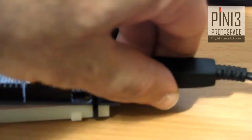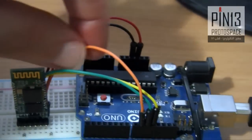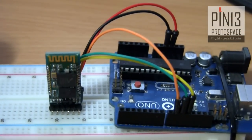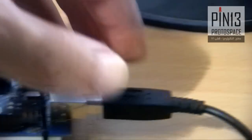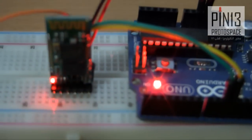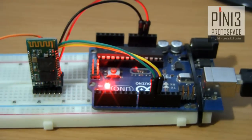Once I'm done with this, I remove the power from the Arduino. Now I need to remove the key pin — this jumper wire connected to pin 9 on the Arduino, which is connected to the key pin or pin 34 on the HC-05. I disconnect it and plug it into an empty area on the breadboard. If I connect the USB again, the HC-05 is now blinking rapidly, which tells me it's ready to be paired with another device and ready for transmission and reception.